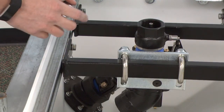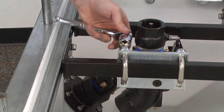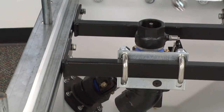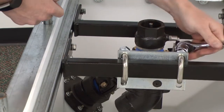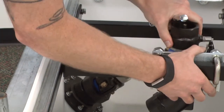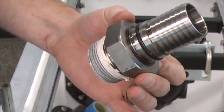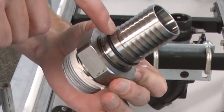Next, you'll want to loosen the riser pipe or shear valve depending on whether you're using a loop sump or a traditional sump. This will make it easier for you to install the swivel nut prior to finishing the SBC. When pushing FlexWorks onto the swivel nut, the pipe will only go as far as the pipe stop. The pipe stop can be found here. Do not push past this point.